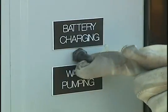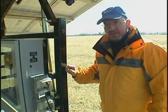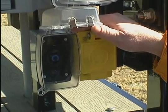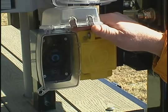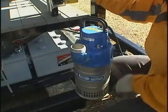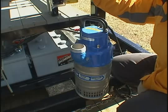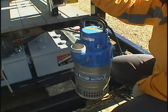This switch controls battery charging and water pumping. This is a patented technology which World Water has developed which allows high voltage water pumping and low voltage battery charging from the same solar array. MobileMax Pure contains World Water's patented AquaMax pumping controller. This pumping controller allows three phase heavy duty AC pumps to be run directly from the sun. The AC pump which is included allows people to draft from various water sources including streams, rivers, lakes, and contaminated city water supply and purify it through the onboard water purification system.